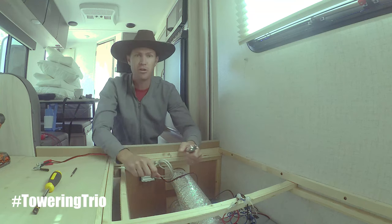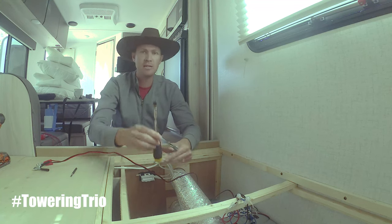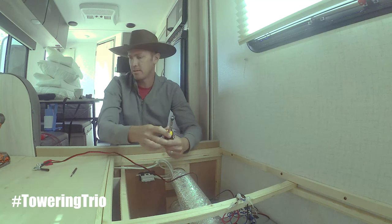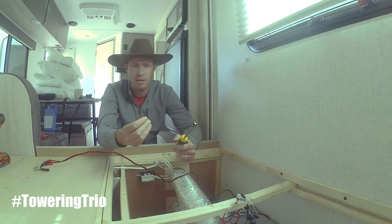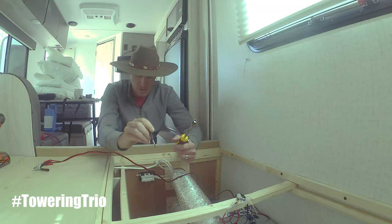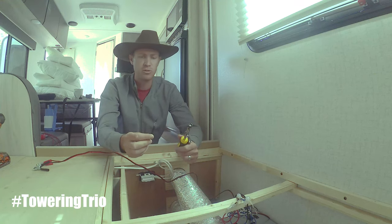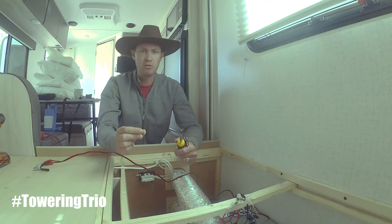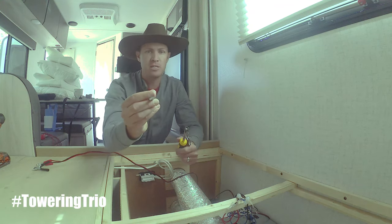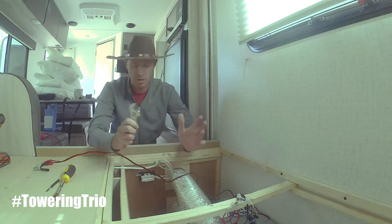You'll need a couple of tools: just a little adjustable wrench for your gas line, a 5/16ths hex for the two hose clamps, and a Robertson R2 bit, which is the square bit. I really appreciate that they use square bits because on our last Winnebago they used regular Phillips. The Robertsons don't strip out — a Phillips will probably strip and you'll get one shot. So make sure you carry some Robertsons if you've got a newer coach. Winnebago switched over and I really appreciate that.